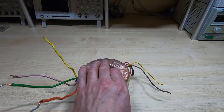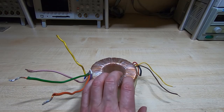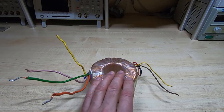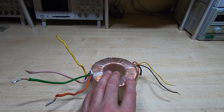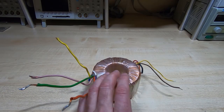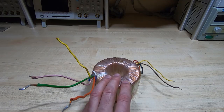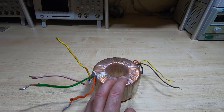That said, I'll connect this up to the mains. Be careful if you start probing around randomly with transformers. I know this transformer — I wound it, so I know exactly how many turns there are on each winding. But if you don't know the transformer, be very wary. It might have high voltage outputs on the secondary, and it can be difficult to determine the primary and secondary on some transformers.